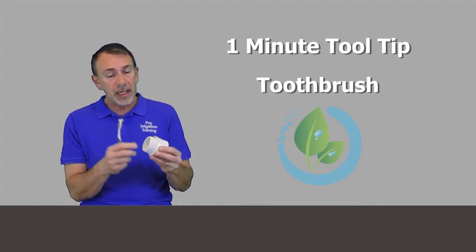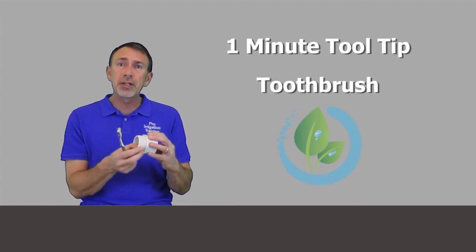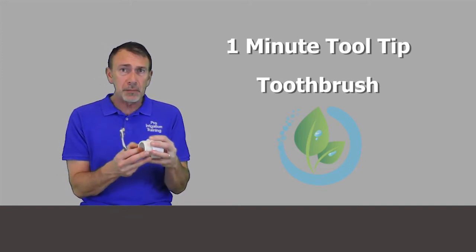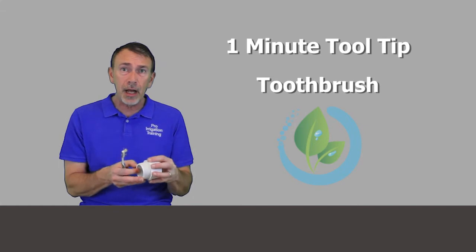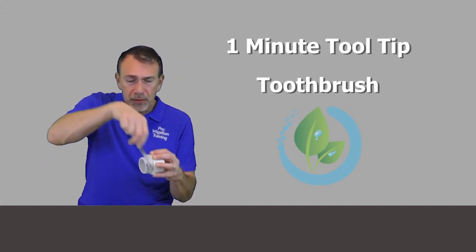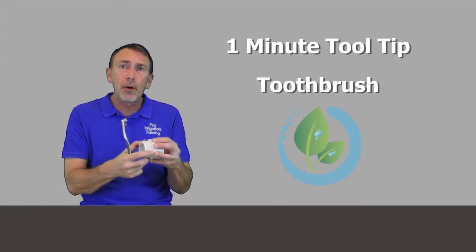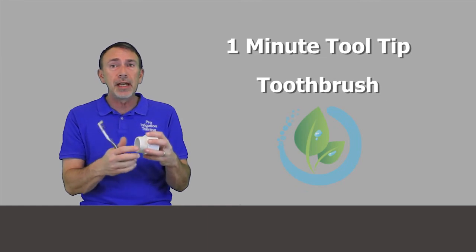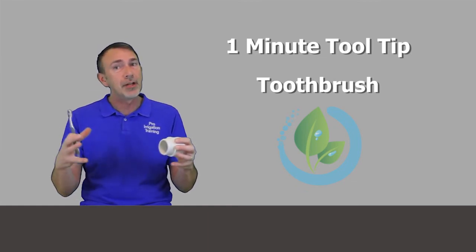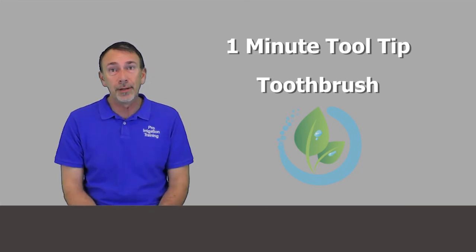Make sure that it's clean. Even if you're starting off with a fresh piece here out of the truck, it can still get some dirt and stuff down in there. I always like to clean them up really good — but more especially if you're doing a repair that's down in a hole and you're bending down and maybe there's some dirt falling in. Make sure you get down in there and clean the back sides of these threads before you put the thread tape on there, because I promise you, if you get into some complicated situation and you don't take care of this, you'll have to undo it and clean that out. One little piece of grit or sand in there can mess the whole deal up.